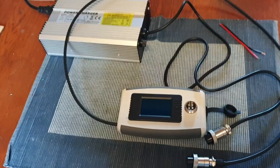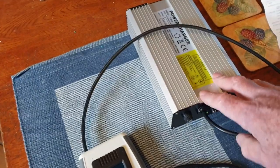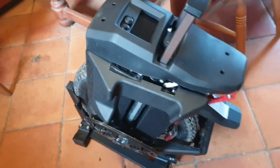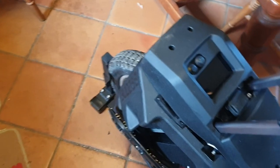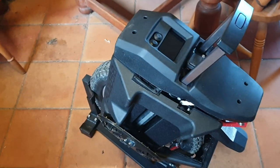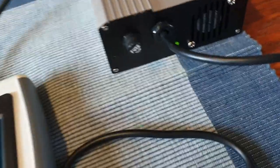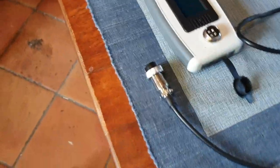So I'll show you my battery charging monitor working. You plug in your power supply — anything up to 10 amps. This is a 3-amp charger because I'm going to use it with my Begode Master here. 134 volts — I don't recommend charging this wheel at 10 amps; that's the absolute maximum. I wouldn't charge this particular wheel any higher than 8 amps. So you've got your charger, you plug it in, you should be able to see the little green light there. Take your charger lead and plug it into the box.